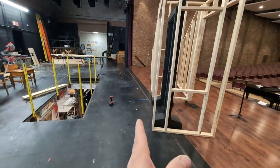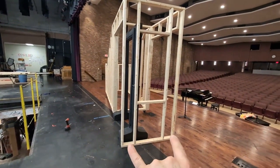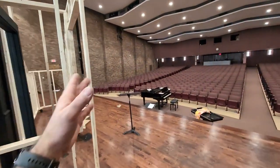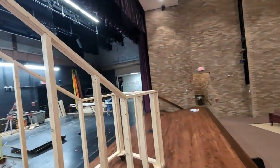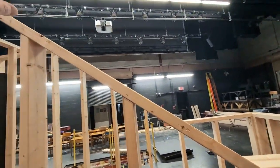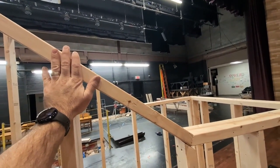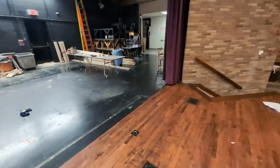I could always slide this out a little bit and try to meet in the middle, but I'd have none of this flexibility if I had left this as designed at 3 feet wide as a set piece. Going to 4, actually it's 47, and that's another thing. I went to 47 wide overall, so that when we put the stringer up and we put a stair tread on there, and we want the stair tread to hang an inch over to give it the visual interest of a stair tread that's finished into a room like this with an open baluster, and we want to make the treads, if we made this piece 48 inches wide, then you want to cut 2x10 or 2x12, which is an expensive piece of lumber.